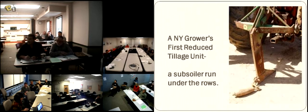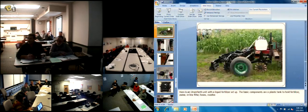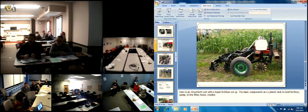So that's what got me started, and I've been experimenting ever since. The following year I built a two-row unit, which included the Hiller disc, to try to do everything in one pass. Similar to George's — the only difference is I've got straight shanks on mine and a set of spider wheels that run behind the ripper shank to break up the clods.